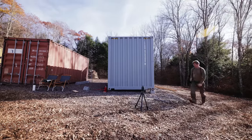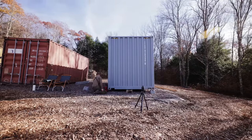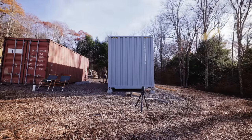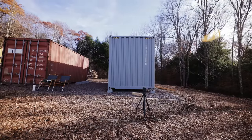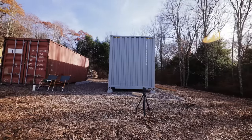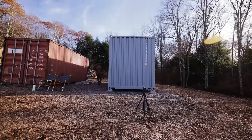I tried to take my time with the leveling process, not to rush, and to set up the hydraulic jack as stable as possible. The less height you lift, the more stable things stay. I can see how a very skilled person could level an entire container with only 2 adjustments, since the little jack actually lifts most of the container off the ground. But I took my time and went at it with a series of smaller moves, and the entire process only took a couple of hours.